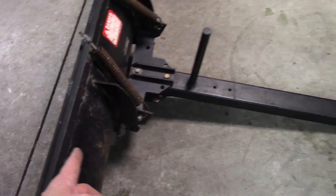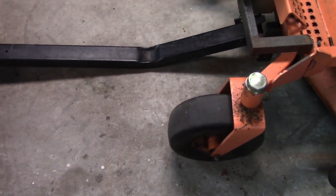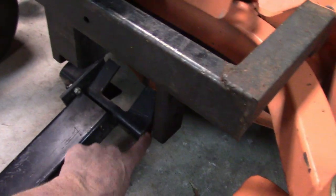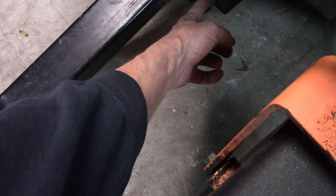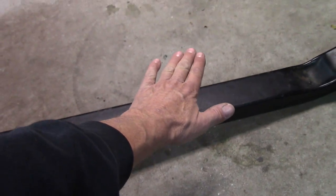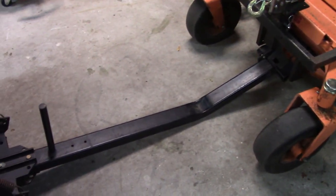The first thing — this is angled which I'm going to keep — I'm going to cut this off about right here and then shorten this all up because I want to get this blade as close to these wheels as possible. That's where the blade's got to come back to because I want to be able to back up without any problems. When I bought this, there was nothing else with it — there's a bar that this attaches to and latches down, which is spring loaded. I'm just going to cut this off and weld it to probably down here on the bottom because the winch is going to have to pick it up. I only have to get it off the ground 6 to 8 inches but it should all work out pretty decent if I do it right.